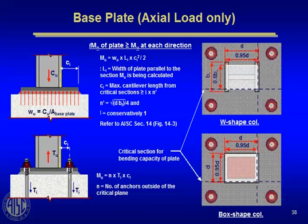Then our base plate simply is carrying the compression load, which is really good at doing. It's not trying to resist a high uplift force, and therefore that weld around the perimeter of the column isn't near as critical as it was if you try to take a big force, uplift force, through the base plate. So think about the best load path is usually the one that's the shortest load path to the foundation. That's from the column directly into the anchor rods into the foundation, not through the base plate and the base plate weld. But in light loads, what we show here is fine.